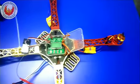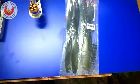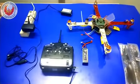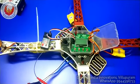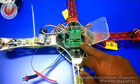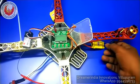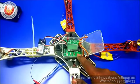First, let me go through the quadcopter parts one by one. Initially, this is the KK board. This KK board is used for controlling the entire flying system. It is a controller board that controls the motors via ESC. These brushless motors are controlled by using the ESC — electronic speed controller — and this ESC is driven by the KK controller board.